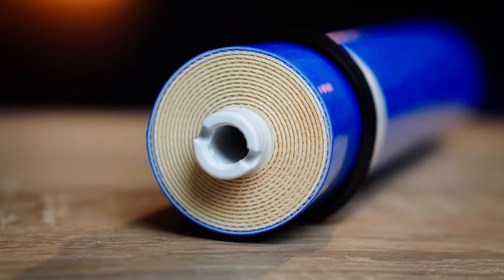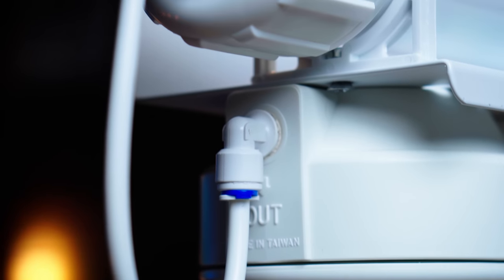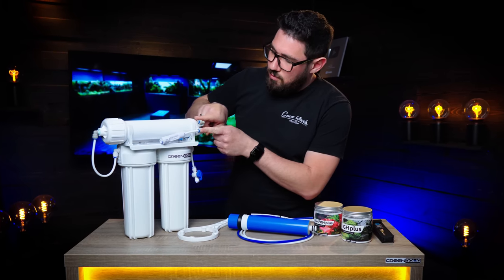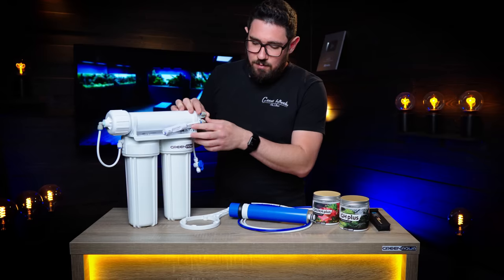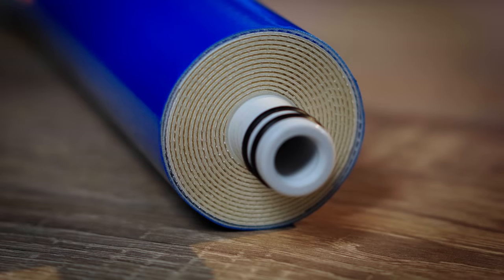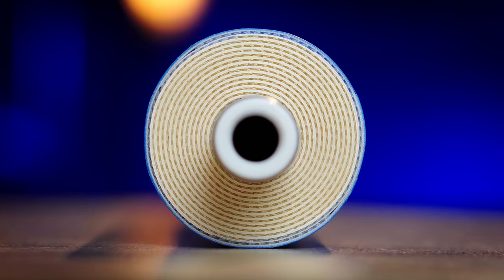That's where the membrane comes in. This is the piece that's inside this housing. The water went through the two pre-filters, and then on this hose it goes into the membrane housing. In the membrane you have this, and then on the other end you have two outcoming lines. One of them has a flow restrictor, the other one is free. The free one is going to be your soft, clean water. The one with the flow restrictor is going to be your waste. This is the membrane from the side — it's rolled up in a way that you get a lot of layers separating each other.